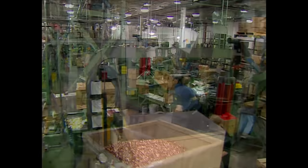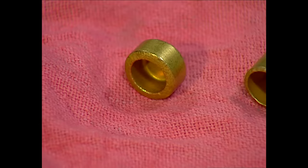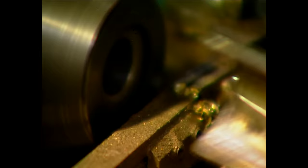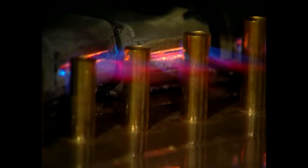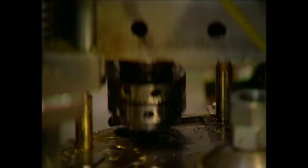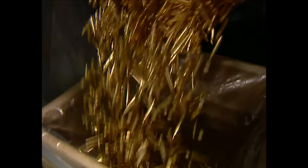Inside, under 800,000 square feet of roof, a thousand employees tend a forest of green machines, specialized presses, since ammo making is mostly metal forming. First, the brass. These are going to be .308 cases after five operations, two trips through the draw press, stretching the brass cup to cartridge length. Then heading, stamping the primer pocket and head stamp in one quick stroke. Next, it's a quick lathe cut to form the extractor rim. Between operations, the cases are heated — it's called annealing — to relieve the stress in the brass, and another conveyor ride to the next operation. The last, in this case, the turret press that necks each cartridge, then trims it and plugs it to size the opening. Now, a final wash in the tubs that look like cement mixers, and we've got shiny new brass.